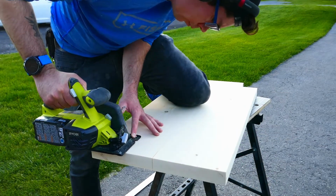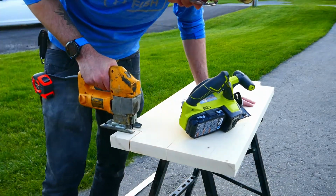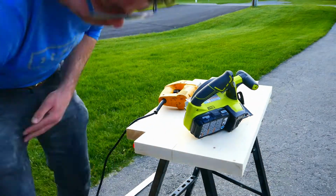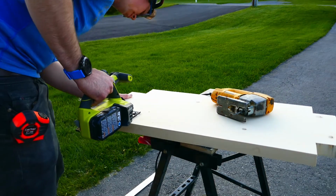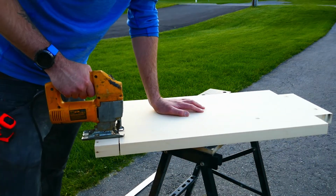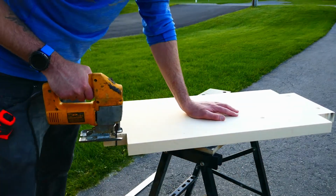I tried to come back with a circular saw and straighten them up, but that left me with more issues. The blade is a circle, so you don't fully cut through the wood right at the corner. So I tried to clean that up with a jigsaw, but it didn't seem to help. Eventually, I used a chisel to get these lines kind of straight, but that was right before the glue up and I don't think I filmed it.